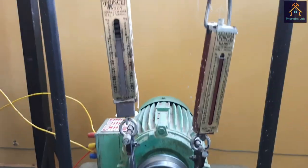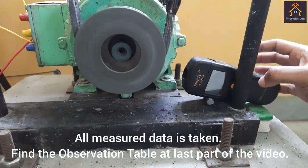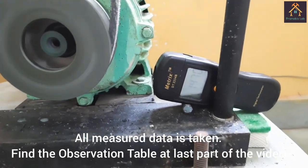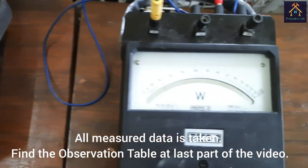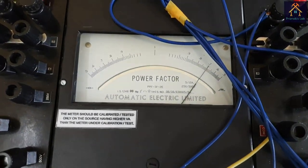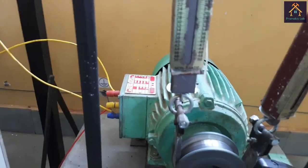Now at 10 kg load, the speed is about 1470 rpm, and the first wattmeter reading is about 50 and the second wattmeter reading is about 150 watt. Now the power factor is about 0.7, voltage is 390 and current is 1.5. We will apply some more load,